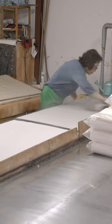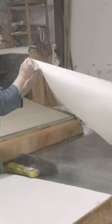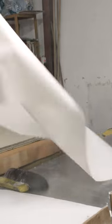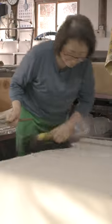The other side of the workshop is dedicated to drying the freshly formed sheets. Yoon Chung-ae tears the crisp, clean hanji off a hot plate set to 88 degrees Celsius. Her horsehair brush is an extension of her hand, used to smooth out hanji without scratching it.